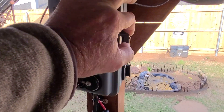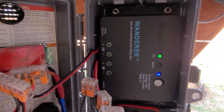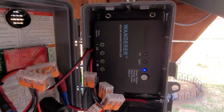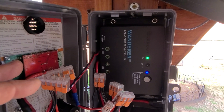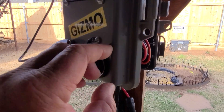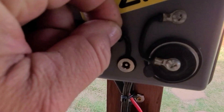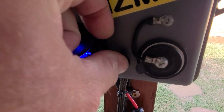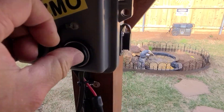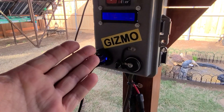I also have a little mini Wanderer PWM solar charge controller in here, which I'm going to swap out for just a regulator. It'll take the PV panel power and regulate it down to 13.8 volts to run a 5.5mm barrel jack for a laptop or power source, a 12-volt power socket, and an SAE 2-pin connector — all at 13.8 volts, no battery needed.